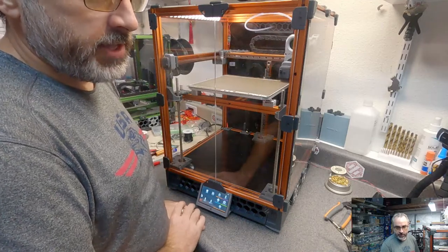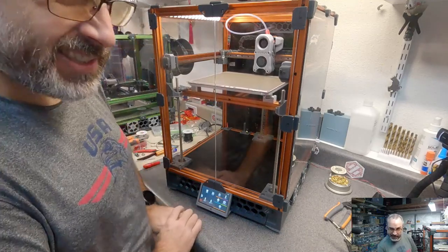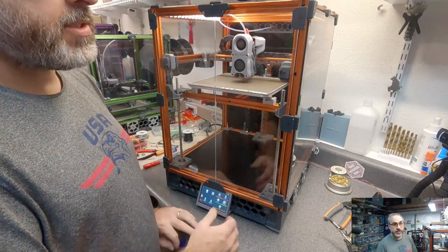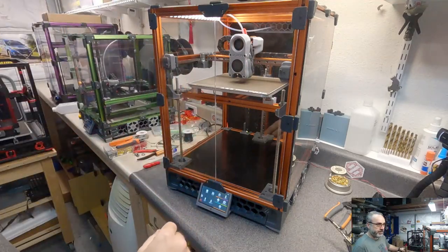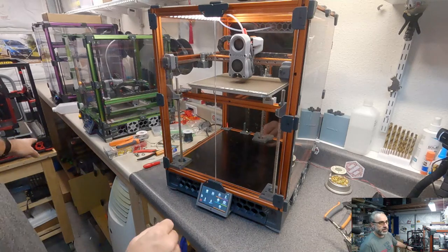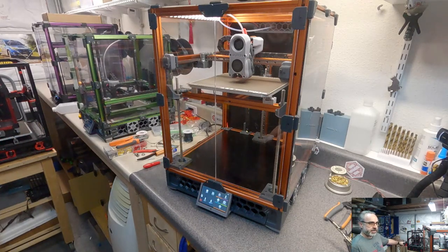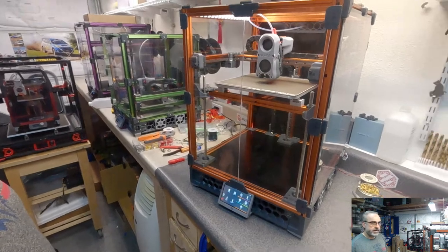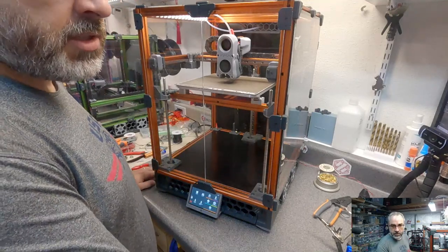Astro Dreamweaver, the Revo hardened nozzle, what do they call that? Obsidian, or kind of Obsidian, but with an X. I like to print carbon fiber filled filaments. That V2 is all atomic carbon fiber ABS from the beginning, from almost 2 years ago when I first built it. I think the V0 that's sitting on top of it is the same atomic carbon fiber ABS. So I like to have the option, and I will also be looking forward to an abrasive compatible nozzle for the Revo.